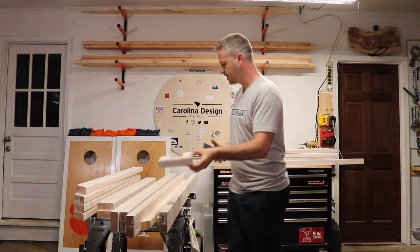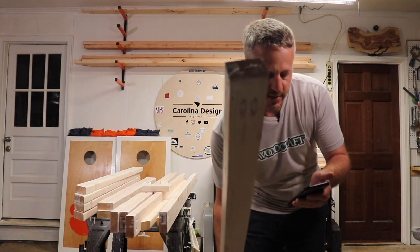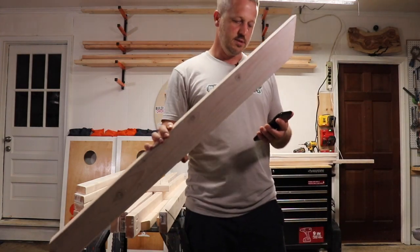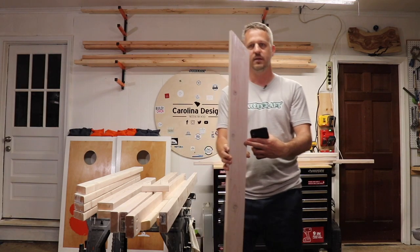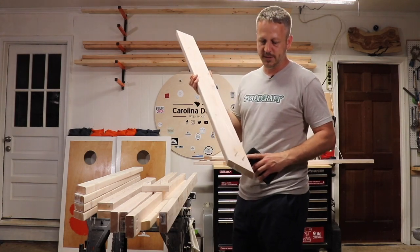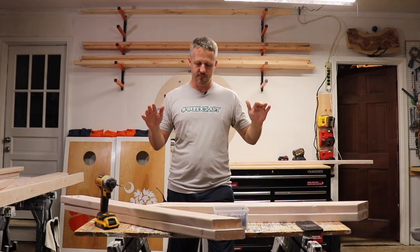One two-by-four that's cut down to actually be a two-by-four frame, pre-cut on both sides already with the Kreg jig holes. Then lastly, two-by-fours that are cut on both sides for the house top — pre-cut on certain ones; this one would not have any Kreg jig holes in it. The ones that do already have the Kreg jig holes. We're going to assemble the roof, then the frame and the chimney. I'm going to start by attaching the top frame of the roof together.